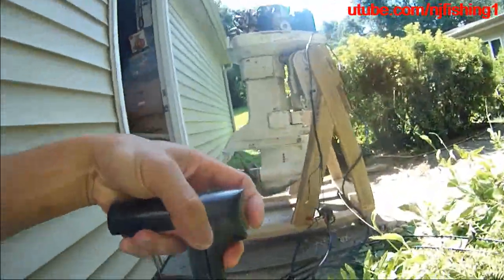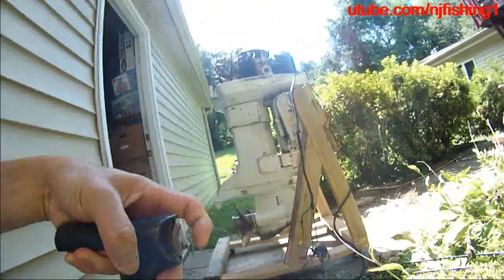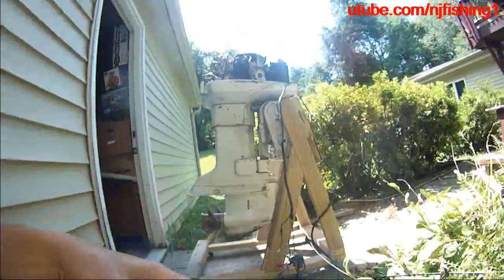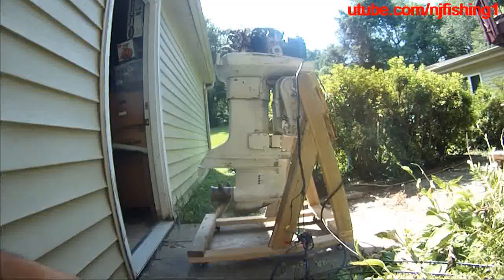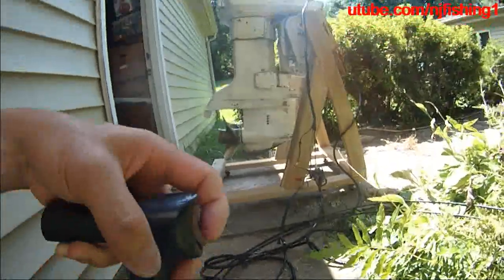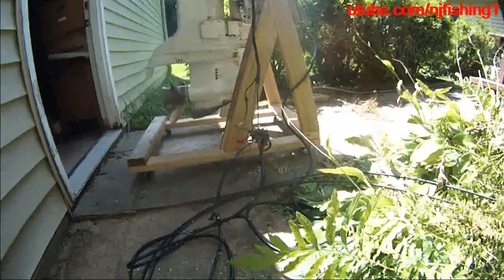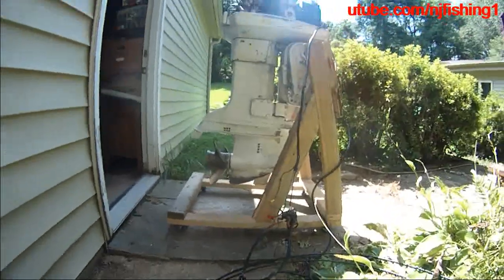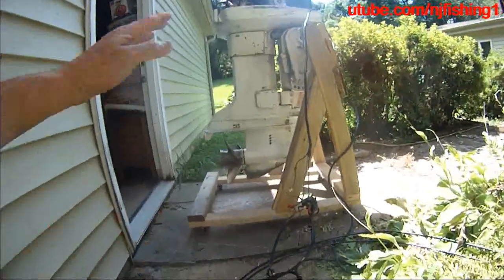You can see this is the remote control. So powering this — I'm pressing the power button down and that motor is tilting down. And I'm powering the motor up — you can see the motor is up. By the way, that's an outboard stand rated up to 360 pounds, and my Johnson 90 horsepower is only 301 pounds. So as you can see, it's on two-inch castor wheels and it's doing pretty good. You can see I'm trimming down, but it's using that car starter solenoid instead of the OEM solenoid to do this power tilt and trim.